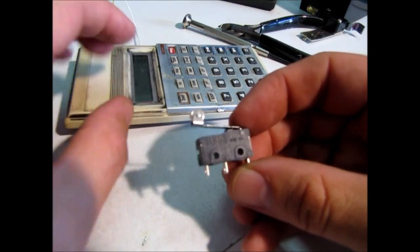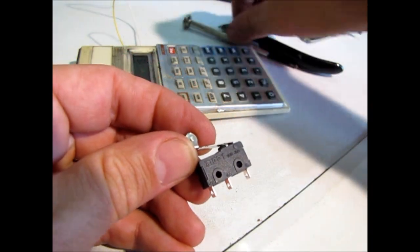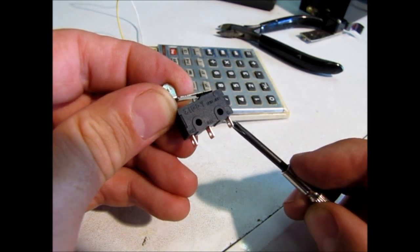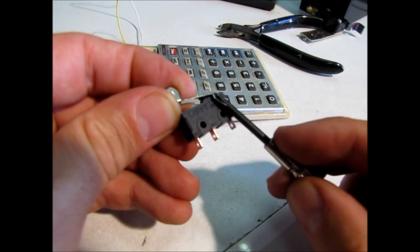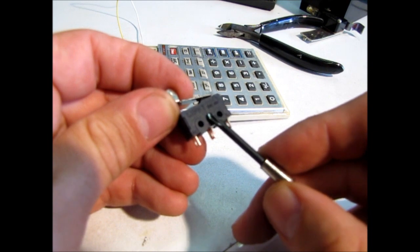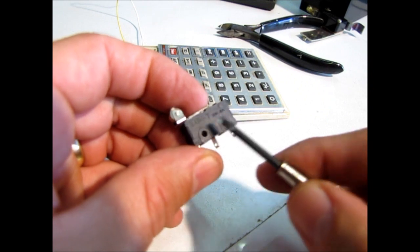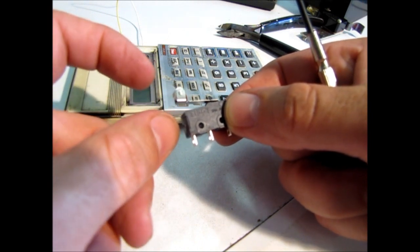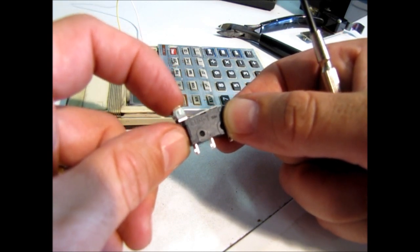What we have here is a micro switch. On a micro switch we've got a common, which it always connects to. Then you have a normally open and a normally closed. Normally closed means in its resting state the electricity will flow through there. Normally open means in its resting position the electricity will not flow through there, but if you close it then the electricity will flow through there. I want mine normally open, so that when I go click, it closes and the calculator will count once — every time I go click it will count once.